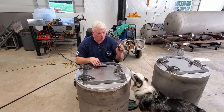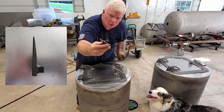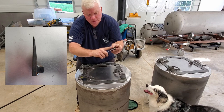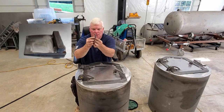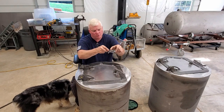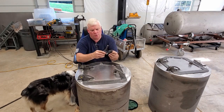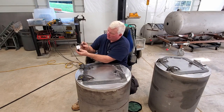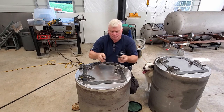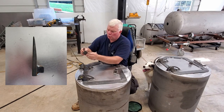You may be asking what this is — you don't have to make a little ramp, but I like to. It's just a piece of scrap quarter-inch by two flat bar that I have taken a sanding disc and sanded a nice gentle ramp on. You could put a 45-degree angle or round it off. What you want is something that this shaft can ride over gently. I like this to be as shallow as I can make it, so that if my door happens not to be closed exactly — if I'm lazy when I'm locking it down — it will hit here, ride down gently, and actually close the door for me.